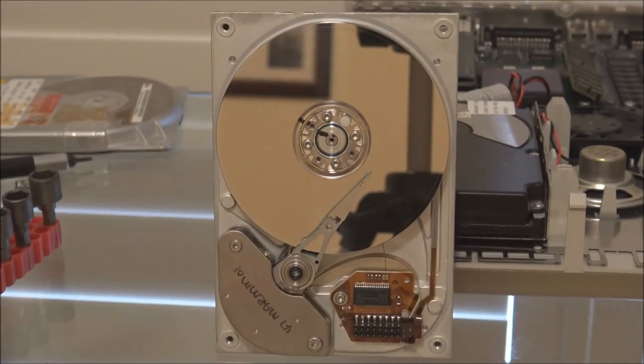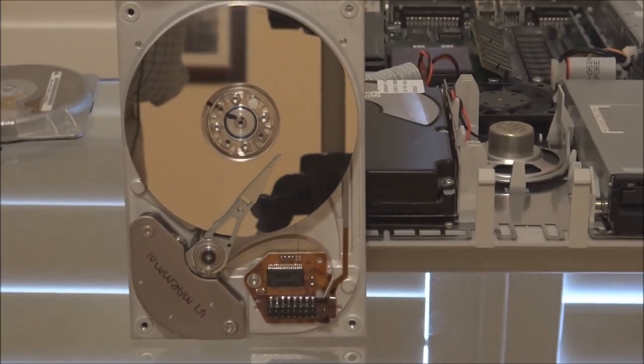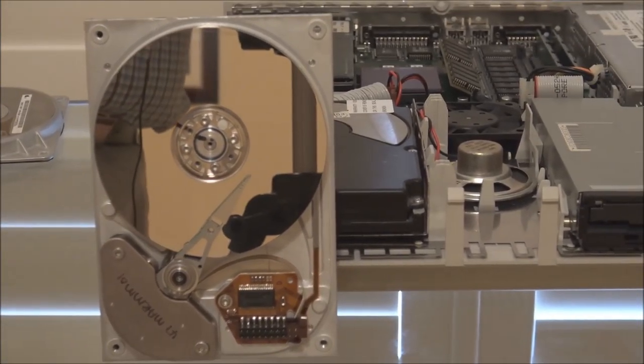Okay, so if you have a drive that will spin up and then spins down again after a few seconds, that's normally an issue caused by the drive not being able to move the heads to perform the self-test. Because when a drive normally spins up and powers on, it will spin the platter up, and then it will get the drive's platters running at the correct speed. Once that happens, the heads will start to move across the disk in various steps. In fact, I'll try and simulate that. If I power this LC475 on with this drive, I'll show you what the drive actually does.